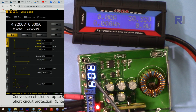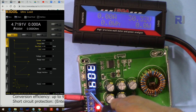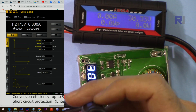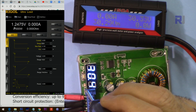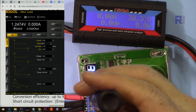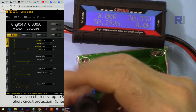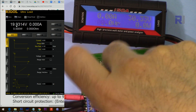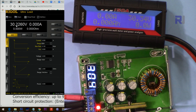Let's test it. The input voltage is 30 volts. I'm adjusting the output — going counterclockwise, I see 1.25, 1.24 volts minimum. Going clockwise, it reaches almost 30 volts output, so there's very little dissipation. Keep in mind this is without any load.